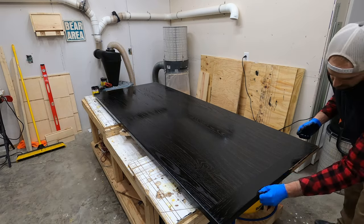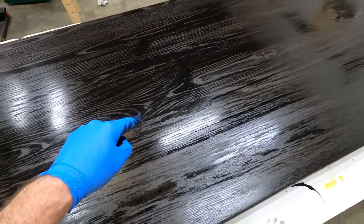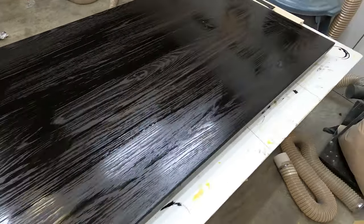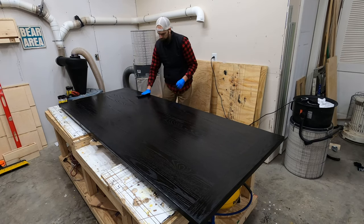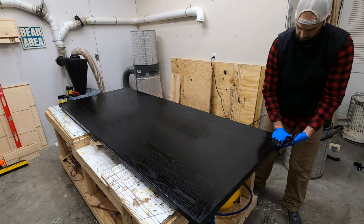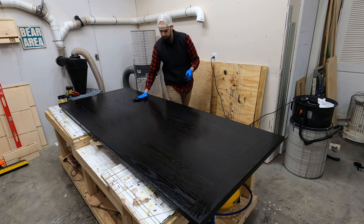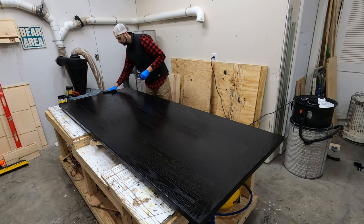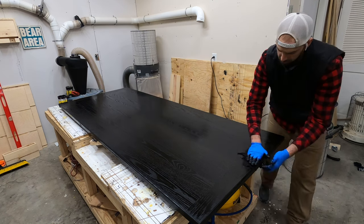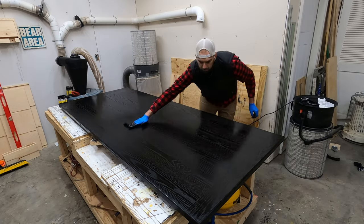At this point we have the entire tabletop completely stained. If we were to stop here, you can see there are several blemishes or smudge marks where I either had too much stain or maybe some excess drips from the rag. So the final and arguably most important step of the stain process, at least for this first coat, is that we are going to go back over the entire surface and eliminate any smudge marks or excess stain. You don't need to put any more stain on the rag — just go over the surface one last time, with the direction of the grain, to smooth all that stain out for a nice surface when this first coat dries.